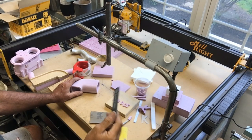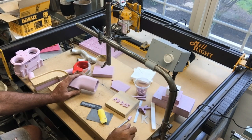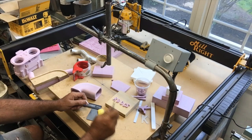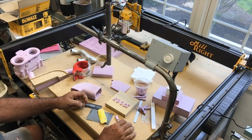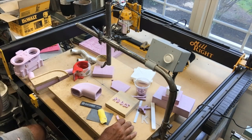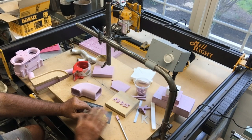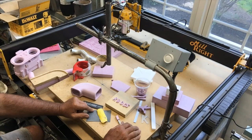You can improve the finish on 1.3 to 1.5 pounds per cubic foot extruded polystyrene foam — all the way up to 320-grit paper you'll see an improvement. If you're using coatings to coat your foam patterns, which you should be, you're going to reproduce the exact same surface finish that you have on your foam pattern. 220-grit sandpaper will get you most of the way home as far as finishing goes. If you're going to do some real gross material removal, take a look at wire mesh abrasive used for drywall finishing. The reason that stuff works well for shaping foam is because the fines you strike off go through the wire mesh and don't ball up underneath and tear as much, so you get quicker material removal.